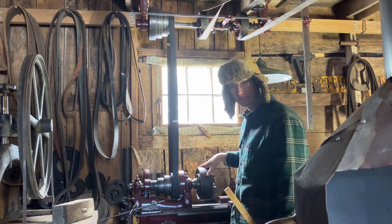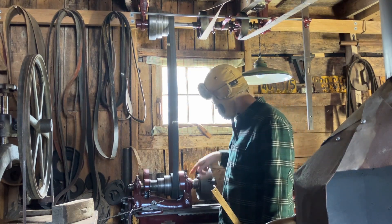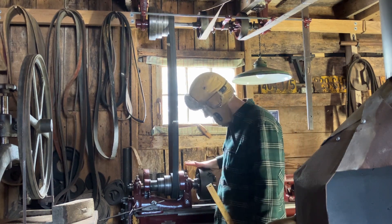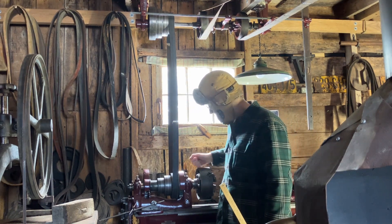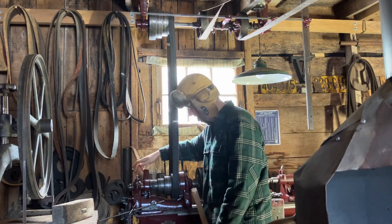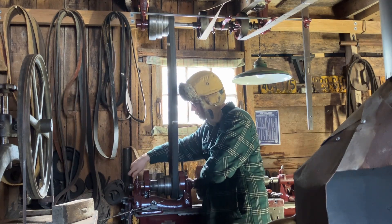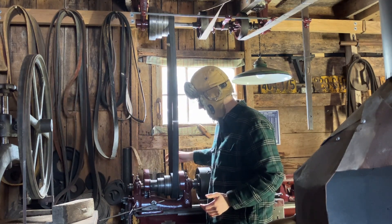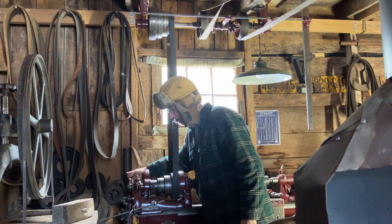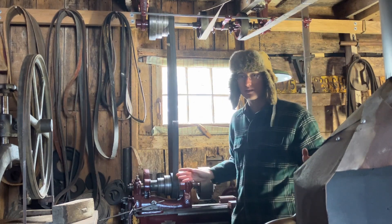This is right now coupled for direct drive. If I want it to go slower than 285 rpm, all I do is loosen a nut and a bolt in here, which disconnects the internal shaft and the outer pulley. Then I flip this lever and engage something like a 3-to-1 reduction back gear, and that slows it down much further. That's how you get different speeds on these old machines when the main shaft is always running the same.